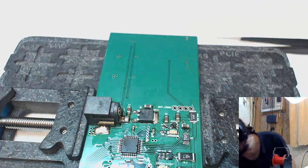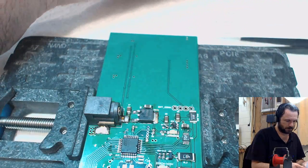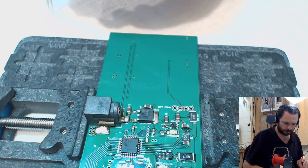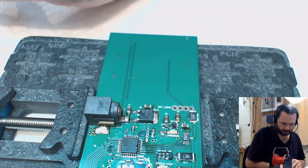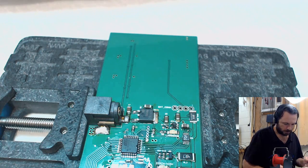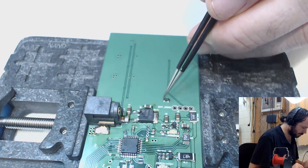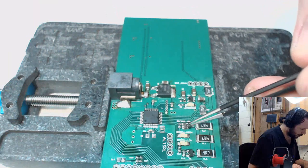All right, I need a MOSFET. Now, because this is pretty much just a control line, there's not a lot of current going through it. We can use a fairly standard, robust, boring MOSFET. In this case, the classical 2N7002. It has the upside that if something goes terribly wrong and it shorts or something like that, its resistance inside is a couple of ohms, up to 4 or 5 ohms, depending on which variant you get. So it won't really do any damage.